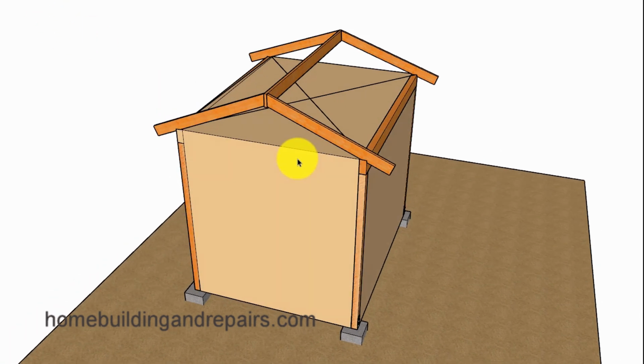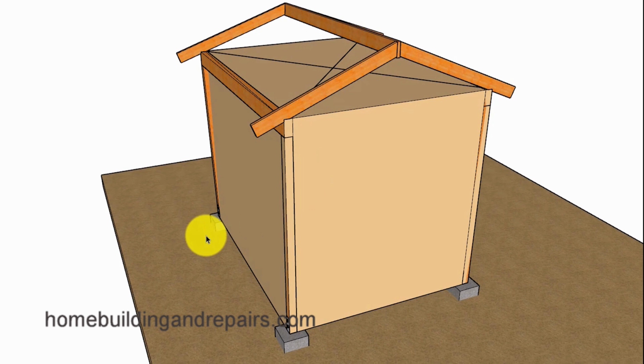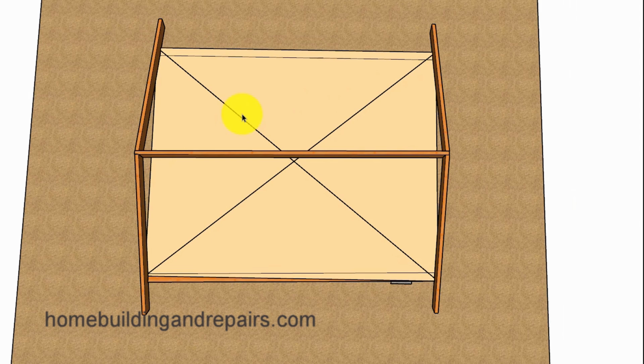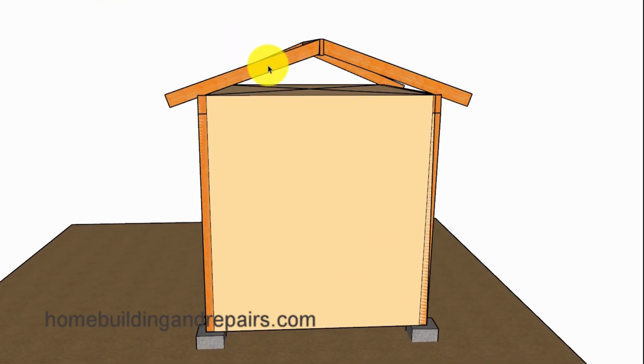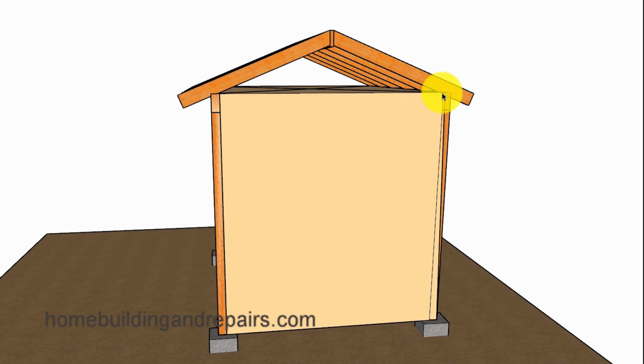And even though our next example is similar, I just wanted to provide you with the most common problem you're going to run into. And that will have something to do with the footings being located in the correct spot. However, one or more of the posts will no longer be plumb or vertically level. And yes, you could end up with a situation where you have a couple of posts that aren't level, especially if you have a level that is not working correctly. Now, I also want to provide you with an example of how the roof will be twisting. And that's because we're using the same rafter lengths. This won't be the same problem if we modify the roof rafters or if we extend the seat cut a little further. And this should make sense to most of you.